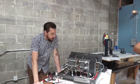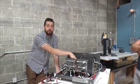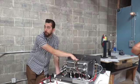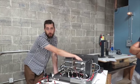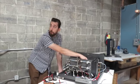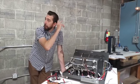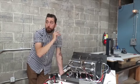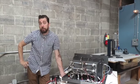So basically the only components that run on high voltage at 220 are the AC to DC converter, which takes in 220 and converts it to 24 volt. The level meter box runs on 220. It uses a really small amperage, but it still uses 220. And then the heating element and solid state relay work together. That uses 220. Everything else on the entire machine runs on DC voltage.